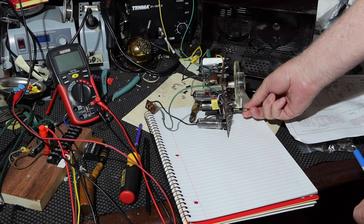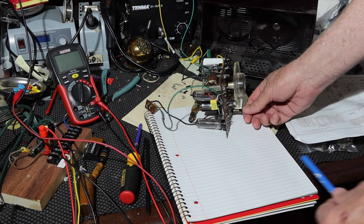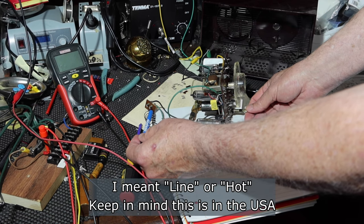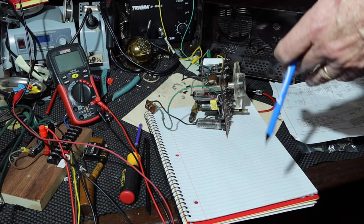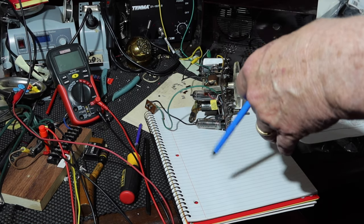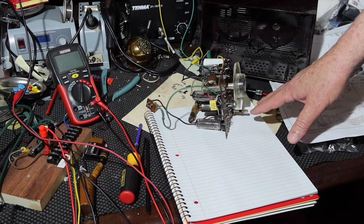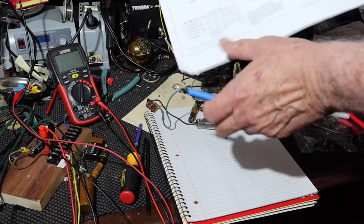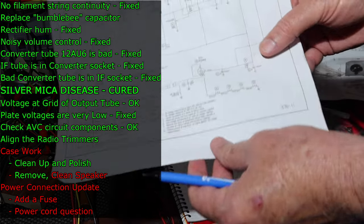in case somebody pulled this knob off and put their finger in there, to see whether that would get them a jolt if the hot went straight to it. So I measured the voltage between here and either one of these leads, because in the real world that might end up being neutral, right? And to see if I would get any voltage there. This was always reading a little bit of voltage, just that phantom voltage sort of thing. So I have another meter that has a low Z check on it, a low impedance check, and I did the low impedance check for both of those and got 0 volts. So anyway, that's what I did. I'm confident that this is not going to be touching even if hot went directly to this. From here, there wasn't any connection through to that knob. It's not grounded. All right.